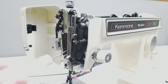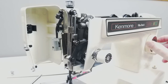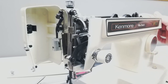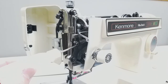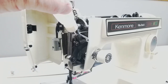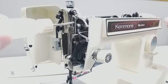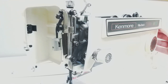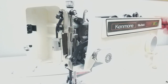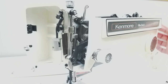If you follow the shaft down like this, all the way to the casting here, you're going to see it goes into this little horseshoe-shaped or U-shaped piece here. Make sure you oil that because when the machine is on zigzag, that's going to go back and forth. Another thing you might miss that's required for the zigzag is right behind this screw — there's a shaft that goes into this piece. Make sure you oil that. That's moving in and out like this during the zigzag motion. Basically just turn the hand wheel and wherever you see little joints that come together that need a little bit of lubrication, the needle bar of course you want that oiled up good. And that's about it on this side of the machine.